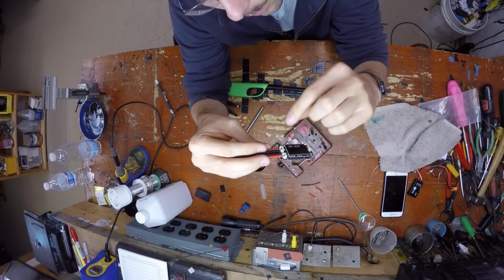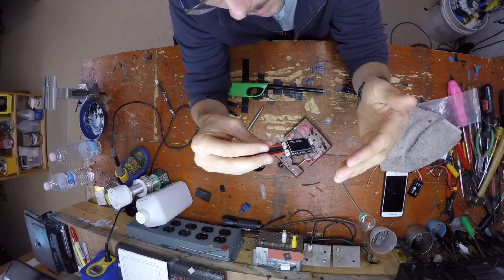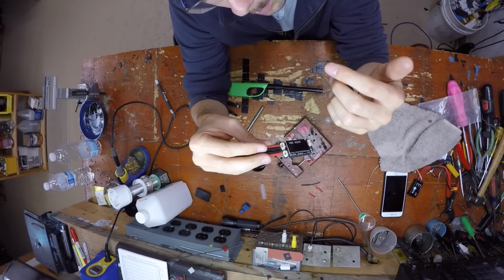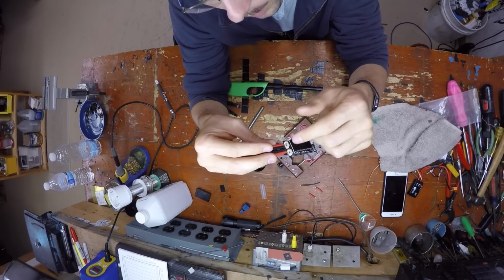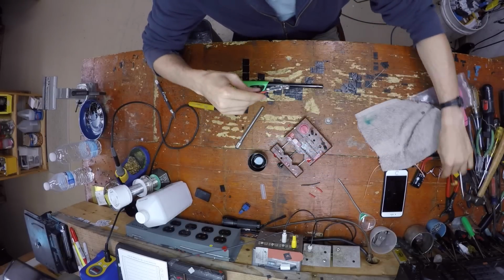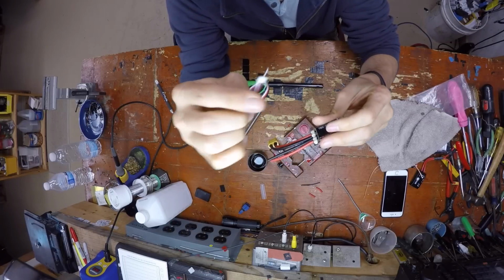And then obviously your camera is going to come out here on this 4-pin, which is designed for some cameras that have a mic on them, so you have an audio coming in. But in my case, my camera does not have audio, so I'm going to run a 4-pin with 3 wires, or I'm going to run a 3-pin that will actually fit into the 4-pin. And I can show you that here. Here's a 3-pin Molex Pico Blade connector.